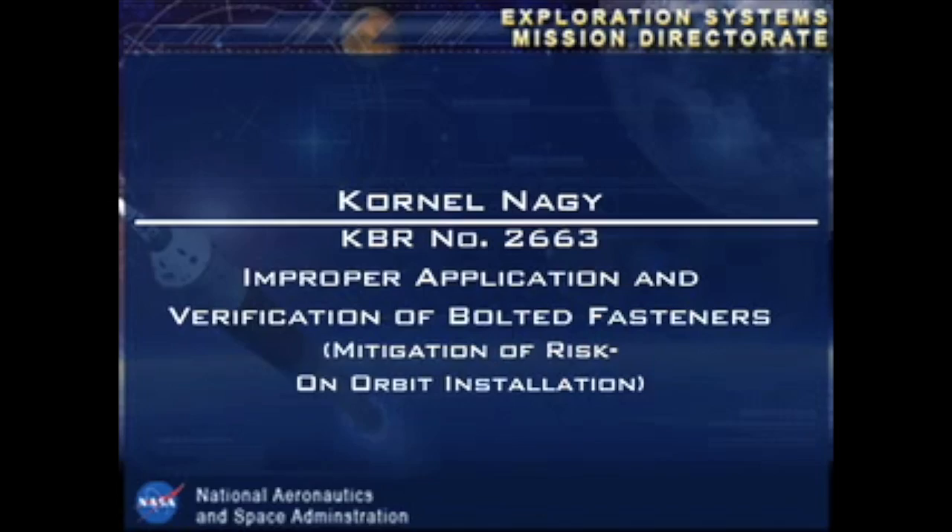The recommendation and the lessons learned for future programs is to have a very meticulous requirement set for the contractors. If they use the existing PGTs, there is some testing and heritage available. But if new devices and new power tools are developed for fastener installation, they must be properly calibrated to achieve the proper torque and assure that the fasteners are performing to the intent and the design conditions.